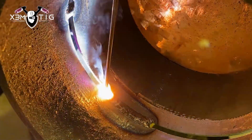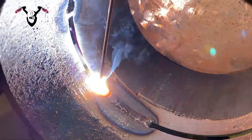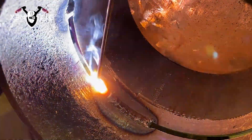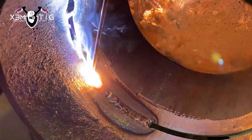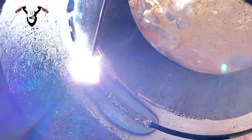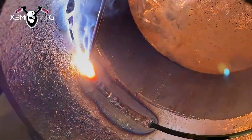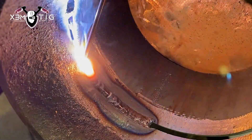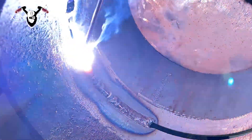I didn't grind any starts, maybe just for the tie-in — that's why we've got feather tacks. When you start, once it begins melting, add the rod and keep it in the puddle. No need to push much — just control how much you're putting in. Basically, if you always hold in the puddle, it'll go by itself. It's almost automatic — you just have that timing.